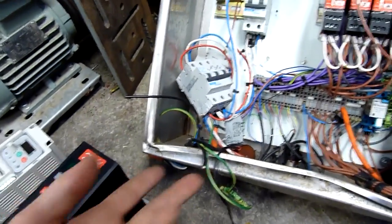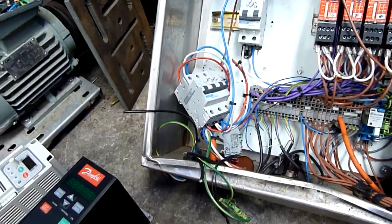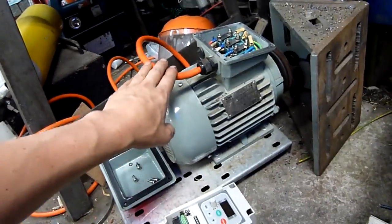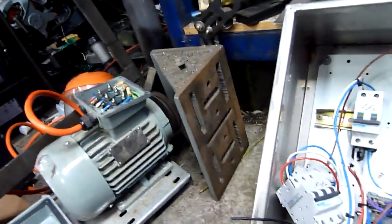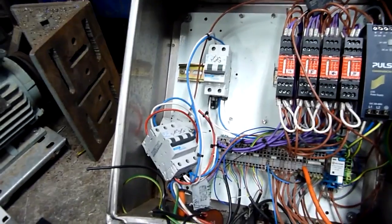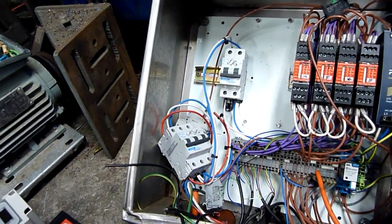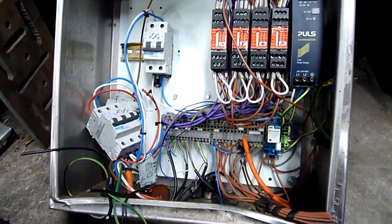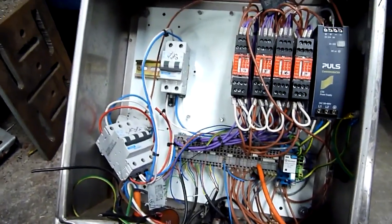240 volts simulated PWM three-phase output — that will run smaller motors. It's pretty much the backbone of my workshop right now. Both lathes and the mill and random experiments are all powered off three-phase motors. I honestly don't know of a single machine in my shop outside of handheld tools that uses a single-phase motor — they're all three-phase.